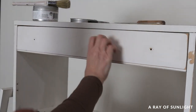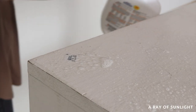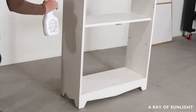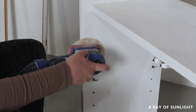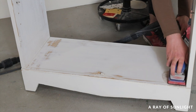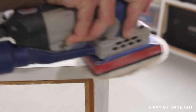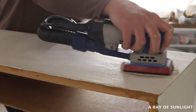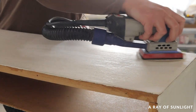It's honestly like magic. Then I cleaned the cabinet really well to make sure there wasn't any wax, grease, or dirt on anything. Then we sanded everything with 150 grit sandpaper to get rid of all the brush marks in the paint. When they were all gone, we went back over everything with 220 grit sandpaper just to make sure the 150 grit didn't leave everything feeling really rough.